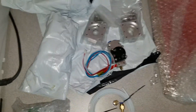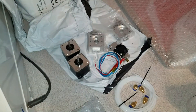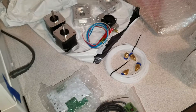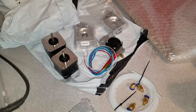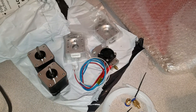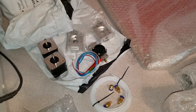This is supposed to be a complete dual-extruder arrangement, not a dual-feed single-extruder. It may be okay — we'll just have to see how that turns out. In the other bag are the two stepper motors for driving the extruders. But like I say, this is not exactly what I was expecting, because I wanted a full dual-extruder capable of printing two completely separate components. Here we'll have the issue of transition between the two materials. It should allow for mixed material printing, which is a cool feature, but not exactly what I was looking for. So that's a little disappointing.